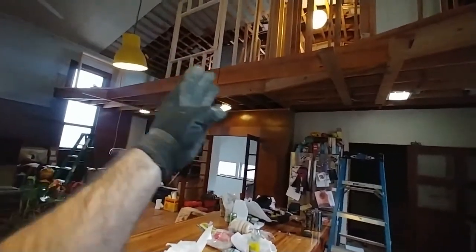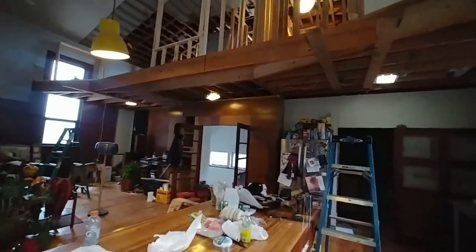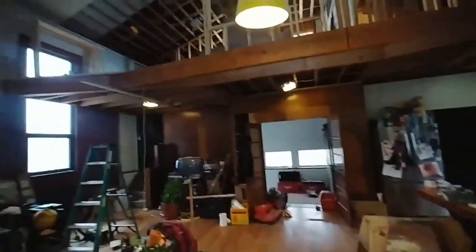And then I had a center line on him, and I just checked it to the center line of the building and the landing up there with a carpenter's square. Slid it back and forth and just pinned it with a couple construction screws for now. We're going to get LVL acute angle hangers to put the ends of it in, which will hold a 1¾ width instead of the 1½, which is the ones that we bought for regular framing lumber.